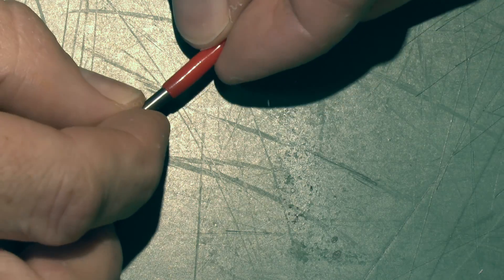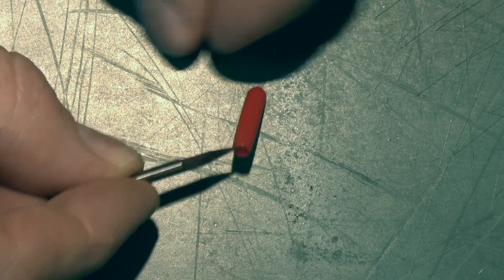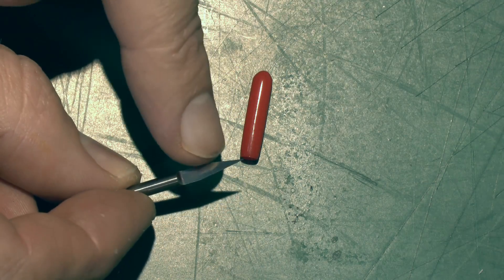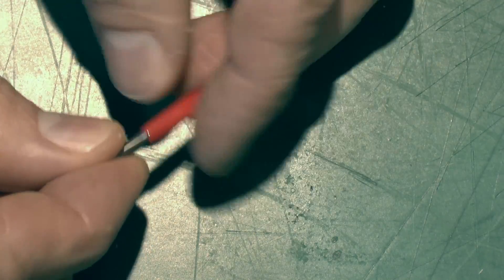Just have a look at the cutting tools we're going to use this time. This is what we're going to use for the text engraving — this is a carbide cutter, a very sharp item, 0.1 millimetres at the end, 20 degree angle, so very sharp, single flute, and it's an eighth-inch shank. Quite a small item for that.